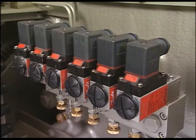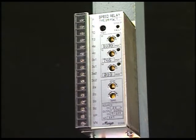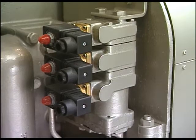The protective device generally consists of lube oil low pressure switch, jacket cooling water high temperature switch, speed relay to catch the engine overspeed, electromagnetic solenoid valve to stop the engine after receiving the signals from these switches, and air piston for stop.